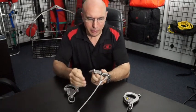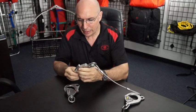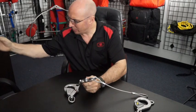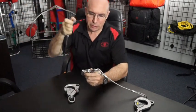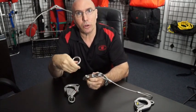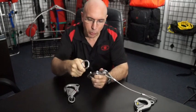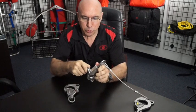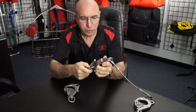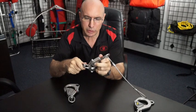This is the oldest style hook that a lot of us older guys were used to — the old mil-spec hook — and it's really susceptible to dynamic rollout and ring rollout. One of the things we would do at LSS is make sure that anything we designed to hook up to this hook would not have the geometry that could roll out. So this is the ring on our 190 sling, and if you tried to get it over the top of the beak, it wouldn't go. While the hook is susceptible to dynamic rollout, the gear that we made that was hooked to it wouldn't, and that was our safety on it.